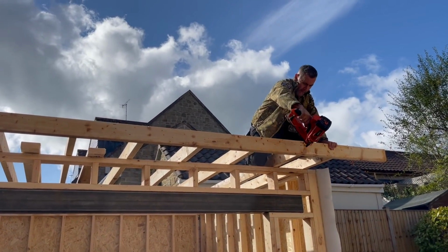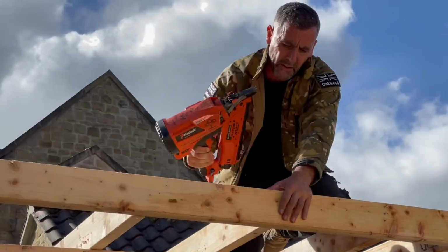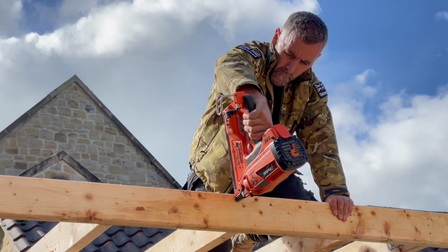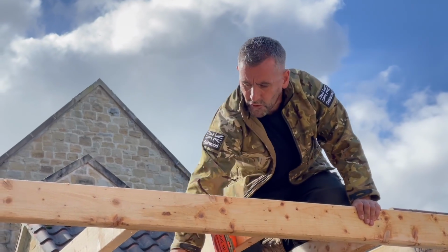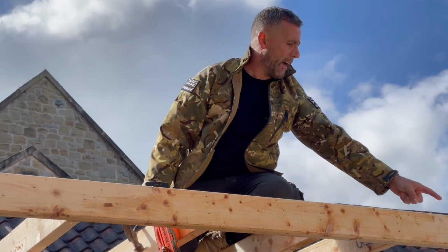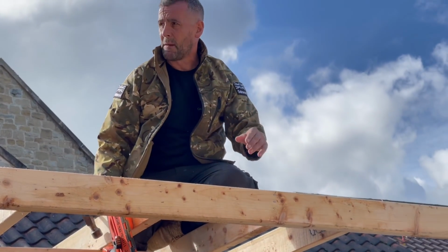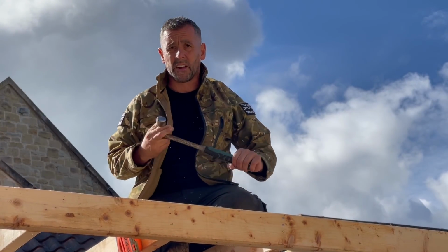And if you've got a hammer, David, obviously with knots it's pounded back out, so he'll lift that up and down a little touch, too much, up, and we'll go along basically, and that'll be the front trimmer on. So we'll do the same on the back, we'll put a back trimmer on. I've let it overhang there, and then we're going to put the side trimmer on, put some noggins in there, support that. And that'll be the roof, apart from the noggins, which I'm going to show you how we're going to get in a nice straight line as well.